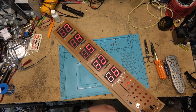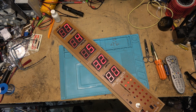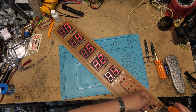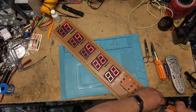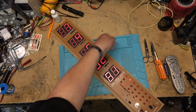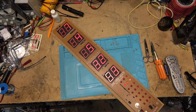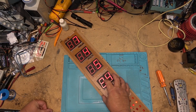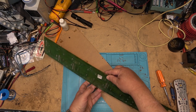I've got to remove the screws that hold the circuit board down, flip the whole board over, and see where the connection problem is and see if we can get it resolved. Nothing more annoying than having it flicker and go out completely. So once again it's this one that's bad — we're going to flip the display over.